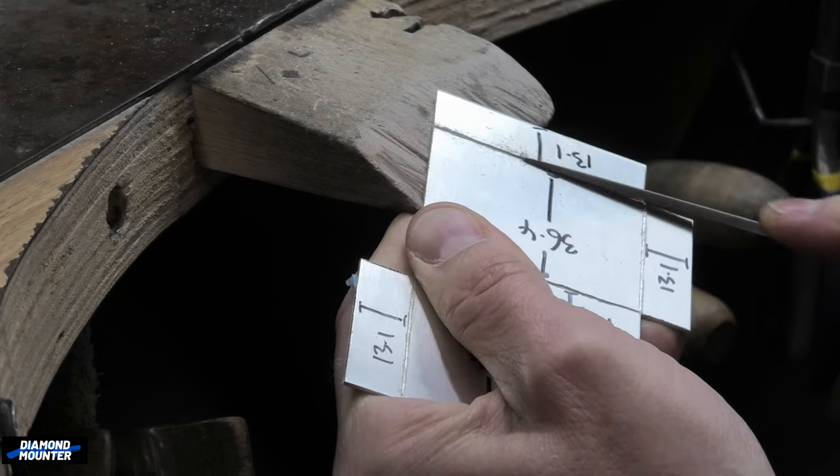This is a new bit of sheet so I've got to take the plastic off, then anneal it and fold it up — end up at the same stage. I've just annealed it, it's still hot. It looks like that because I've fluxed it in all the grooves before annealing so it's ready to fold up and good for soldering. Feeling nervous because it needs to fold up into a really nice square shape and the dimensions have to be just right — it needs to slide in and out with a bit of resistance, not too much, not too little.